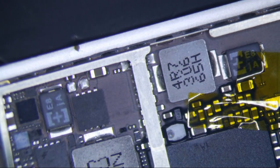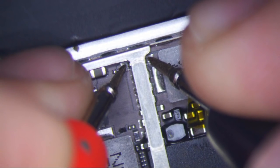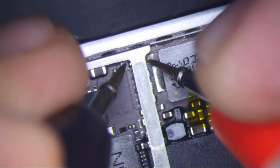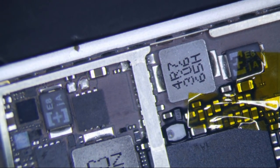In order to test it, put your multimeter in diode mode — and this is true for any diode — and just put your lead on it both ways, so it doesn't matter which lead you put on first. This one is in diode mode and it says OL this way. Now I flip it to the other side and it says 1.9 volts, then goes to OL — so basically it's open. This thing is dead. It should read right around 0.2 volts, anywhere from 0.2 to 0.7. If it reads one-point-something going one way and then some voltage going the other way, then it's a bad diode. You can also compare it to a known good working iPad or iPhone and compare it that way.